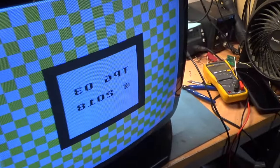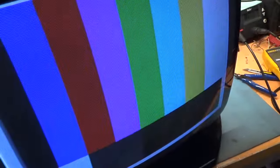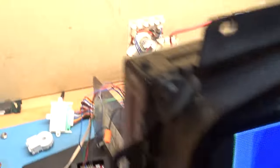I need to go through and do some adjustments. You can see it's already inverted. I need to flip pin 4 — DIP switch 4 — and that should give actual RGB. There we go. If I flip DIP switch 4 back off, it flips back to inverted. It's BGR because the horizontal yoke winding connector is backwards, but we are not burning up this resistor — if anything, it's barely warm.